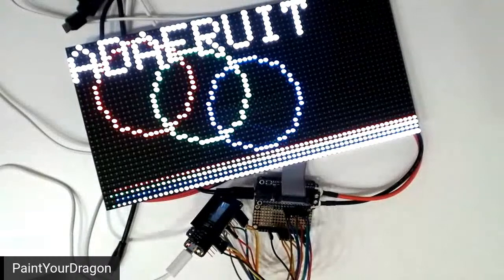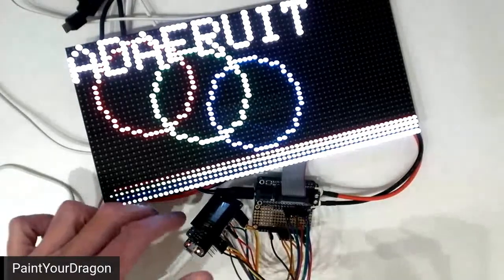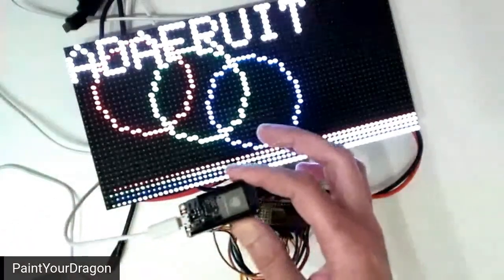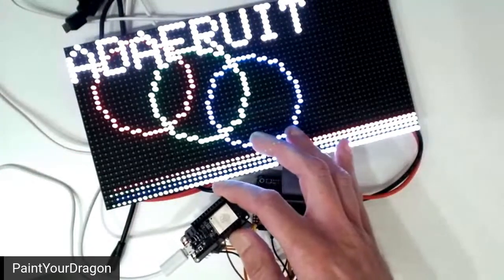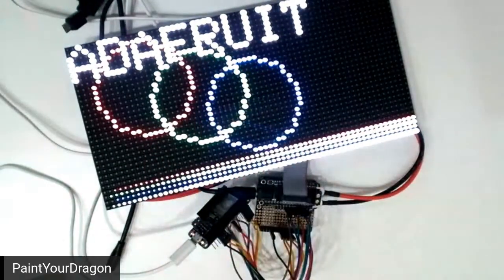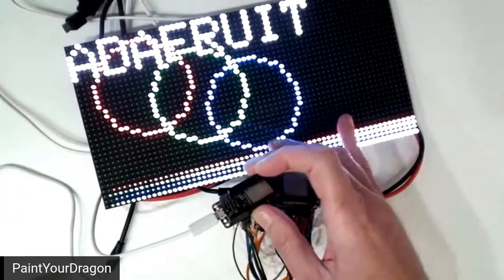Okay. So I keep bringing this same fragile pile of wires by week after week. It's not actually the same fragile pile of wires every week. It changes very slightly. And so this week, the fragile pile of wires is connected to an ESP32 Feather board. So we have this newish library called Protomatter for driving the RGB LED matrices. And one by one, we are porting it to new boards. So we have SAMD in there. We have NRF52, we have STM32, and now we have ESP32 support in there.